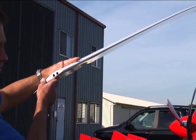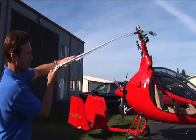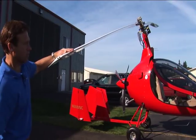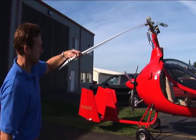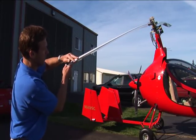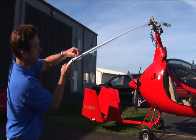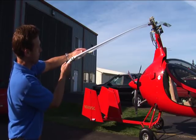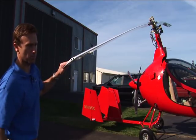The finish on these rotor blades needs to be waxed. Use any wax like a Mother's cleaner wax, or a wax that prevents bugs from sticking. This is a very tough, durable finish, but you can see the bugs on this rotor blade. A little water and wipe them down — you can see they come off really easily because they've been waxed. Make sure your rotor system is always clean and free of debris and bugs for best performance.